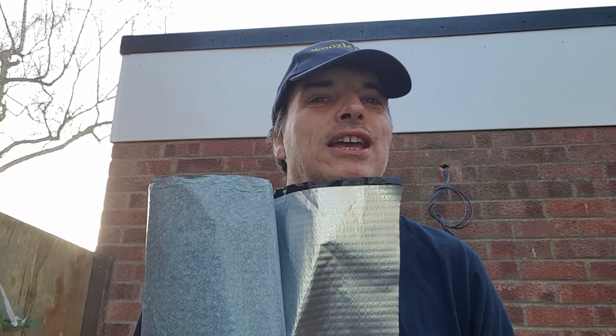Today we're going to be looking at Alutrex 600, which is a foil-based vapor barrier for flat roofs. You can see we used it in the flat roof just above me. One of the real good features I like about Alutrex is that you can actually put it onto the flat roof and leave it before putting on the insulation or the rubber. That's really great because if you're working to a weather window, it means you don't need as long to complete the whole roof.